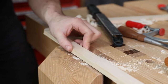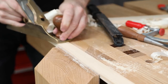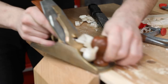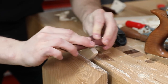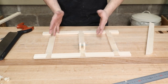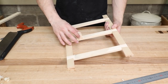I'm going to do one pass with the plane to make sure there aren't any small undulations that are going to create a gap. The other thing is I can just sort out these faces with the plane first as well because they're going to be a little bit difficult to get access to if we try and sand later. I'm going to do the entire frame before gluing this on. And then while this is drying, I can get working on fitting the arm thing for the back — we're going to call it the leg. Nothing fun about sanding. I'm definitely going to be investing in a random orbit sander at some point.